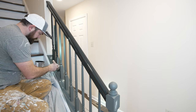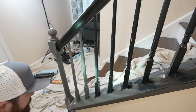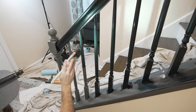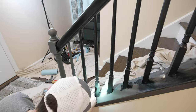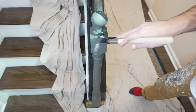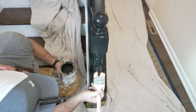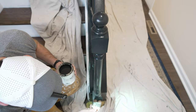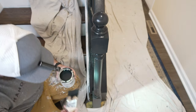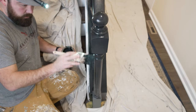Just like you did with the primer, you want to lay it down with the grain and try and do it in sections. Just be aware that Advance, because it has a really long open time — which means it's going to stay wet for a long time — it is prone to drips. Particularly if you have the handrail tilted down, it's going to drip kind of where that handrail meets the newel post. That's really common, so just be aware of that. It's a little bit more finicky than some acrylic or latex-based trim paints.